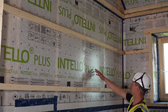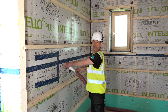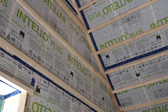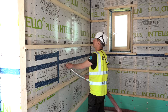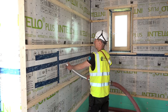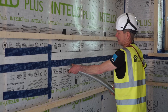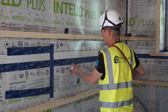You can actually see how the cellulose is falling into the neighbour void. Now it's filling up at the top, so I pull the needle and poke it back up to make sure I really get into the top corners. You can see how it bulges. And I gradually pull the hose out, just going a bit left and right. Just when I come to the end, I poke around that last bit in different directions. And that's it - switch it off.